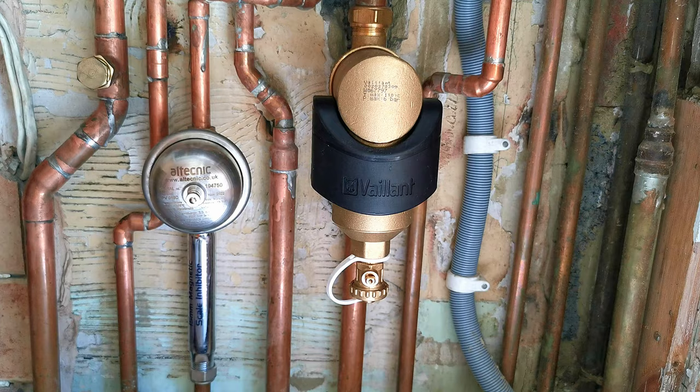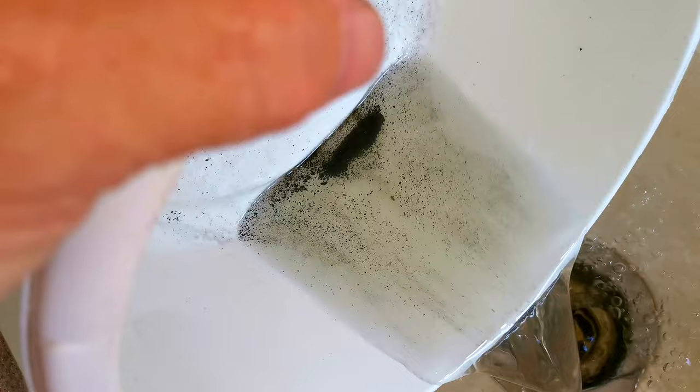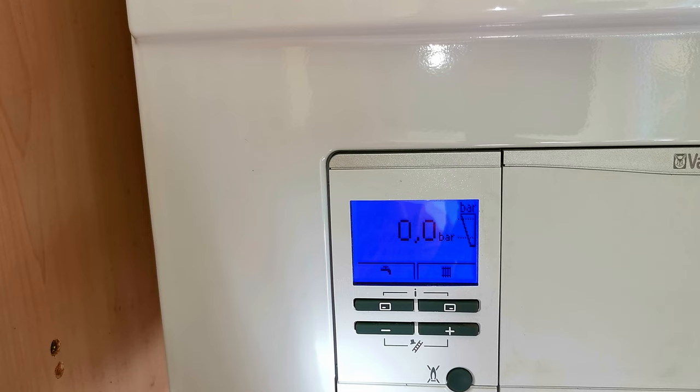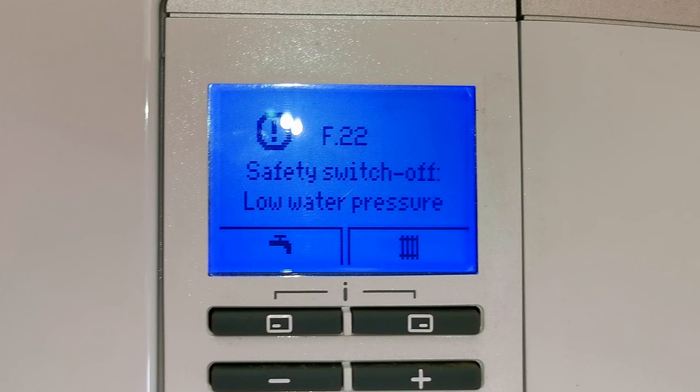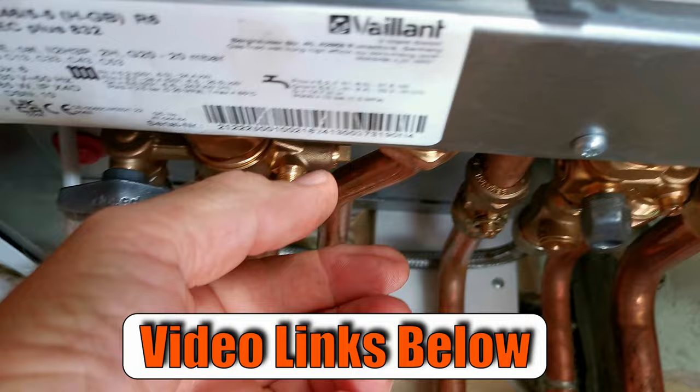In the comments you can let me know what you think of these filters, especially if you're an engineer with a preference for a particular filter. If we look in the bowl we can see all the little bits of magnetite the filter has collected — so it's stopped those bits from getting into the boiler. Now I need to top the boiler back up, as it will probably be at zero bar. Make sure you know how to top up your boiler before you start this process — I've made videos on how to do that and links are in the description.